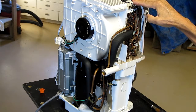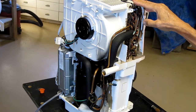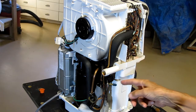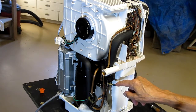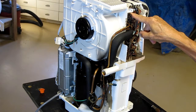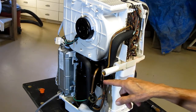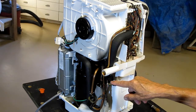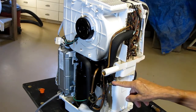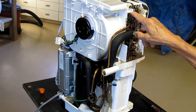So I've got the contaminating refrigerant in here at about one eighth, because the tank pressure on the propane is about eight times atmospheric. Then I run the compressor for a few moments to mix the gases. When that's mixed, I shut the compressor off and bleed it back down. Now I've got the gas at atmospheric pressure — it's one eighth old refrigerant and seven eighths propane. I refill it with propane again, run it for a few moments, and again bleed it down. Now my contaminating gas is not one eighth but one eighth of one eighth — or one sixty-fourth. I repeat the process once or twice more, so I've got my contaminating gas down to like one part in 4,000.